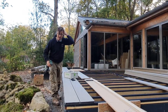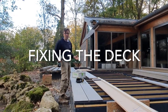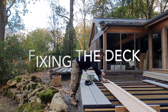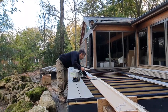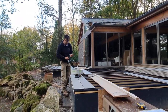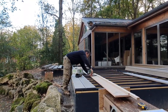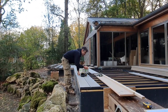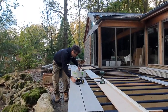I've got all of my boards cut for every position now. I like to set it out, make a list, cut everything to a stop — now I can get rid of the saw table and move it away from where we're working. Then we can start laying the boards, which is the next job. The first thing we did was get one row through nice and straight, and then we start using the clips that come with the Composite Prime system.